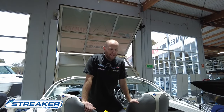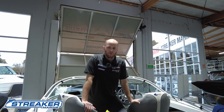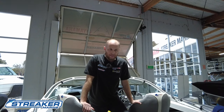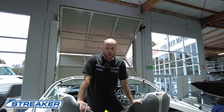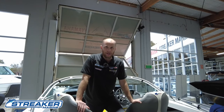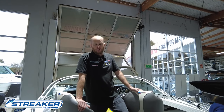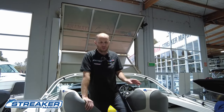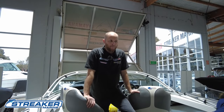Once you're done at the end of the day, idle the motor back down, let it cool back down a little bit, and then you can store it away. Once you've done around 20 hours of running — depending on the brand — bring it in for its first service. After that we're good to go, but we have to annually service the boat, motor, and trailer once a year. Even if you didn't use the boat much that year and didn't do many hours, we still need to service everything — change the gearbox oils, the sump oils, do the bearings on the trailer, and go through our list of requirements.